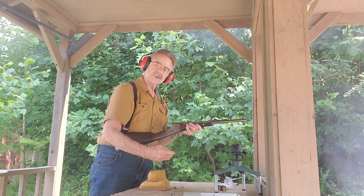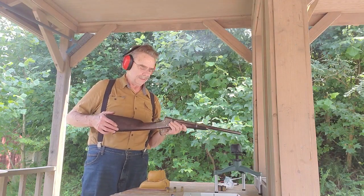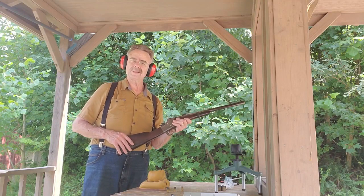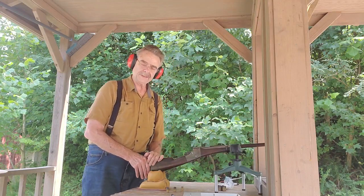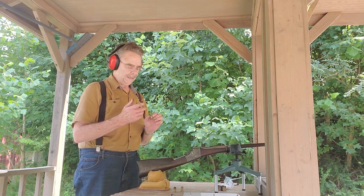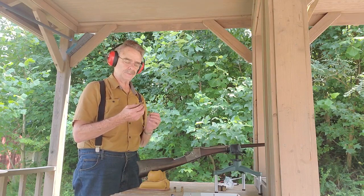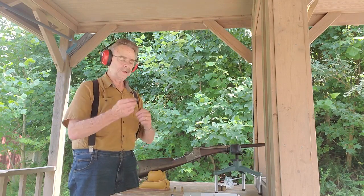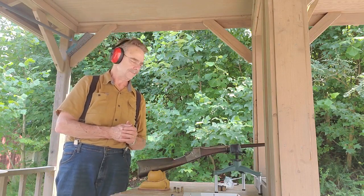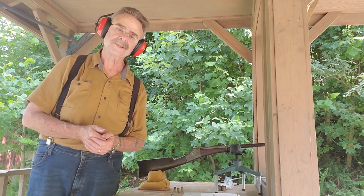Three shots — shoots really nicely, they extract well, they're easy to reload — really no harder to reload than a centerfire round. The key is just getting the routine down to make the cases. You can buy those cases now — Roberson Cartridge Company makes them. I make mine from Starline 5650 centerfire brass, and on my YouTube channel there's a two-part video explaining step-by-step how to convert centerfire cases to rimfire. I hope you enjoyed that — just wanted to give you an update and show you it shoots really good now. This is probably going to be my go-to load for this carbine. Thanks for watching — if you like this video please like it and subscribe, and I'll have more videos coming out soon. Thanks, bye.